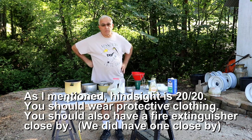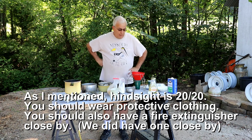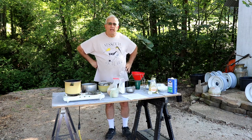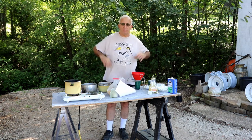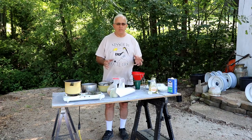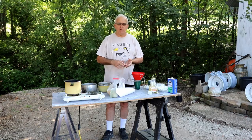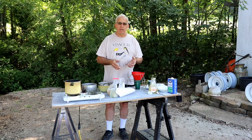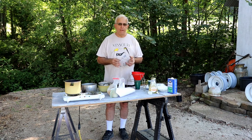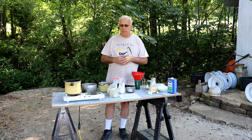Hello friends, Jerry Rosa here, outside the Rosa Stringworks workshop today. We're going to be doing something totally different. I'm brand new at varnish making - this is my very first attempt. I watched a YouTube video and saw a fella doing it. There are as many recipes for varnish as there are luthiers, so this is just one recipe. My main requirement is I want it to be an oil varnish, not a spirit varnish. Spirit varnishes are generally alcohol-based, and I don't want that. Oil-based varnishes are, in my opinion, a better sound producer and the type used on most older traditional violins like Stradivari.